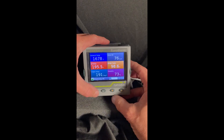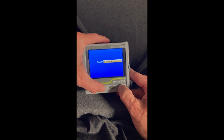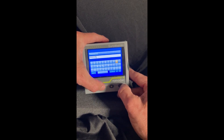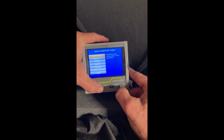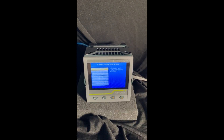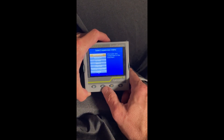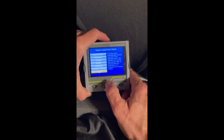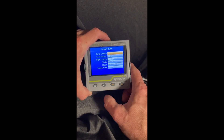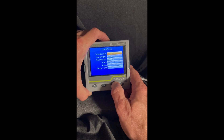So I'm going to show you the supervisor level. Again, hit page, then log in. This time I'm going to go to the supervisor, hit the enter key again, and enter your password. The menu looks the same except we're in supervisor. When you're in supervisor level, your process is still active, so the outputs are still active. I'm going to do the exact same thing — scroll down to my loop, enter, pick my loop, go to tune. This is on because we enabled it in engineering mode; we can turn it on or off. Leave it on.